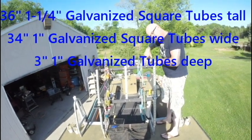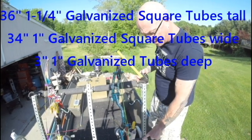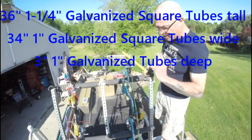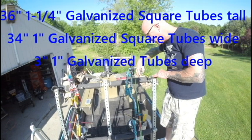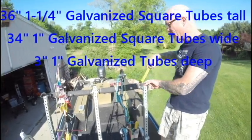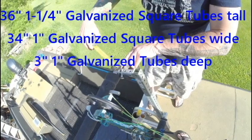On the sides here I built a bracket so this sits back some. This comes back enough to get the bows tipped back a little bit more — you can change that angle depending on what angle you're setting this at. The more straight this is, the further back this would need to be to get a proper seat forward. This 1 inch tube here, this particular bar is 3 inches long. You can see how it sort of sandwiches in right there.